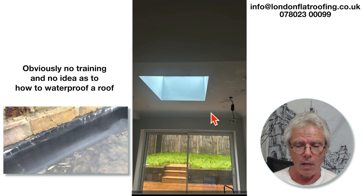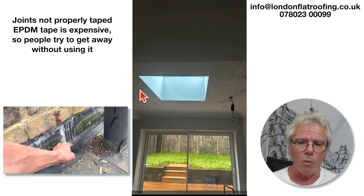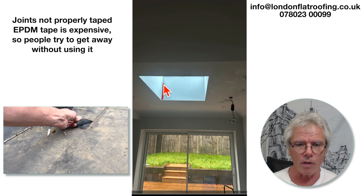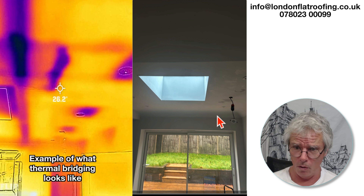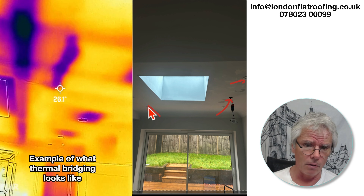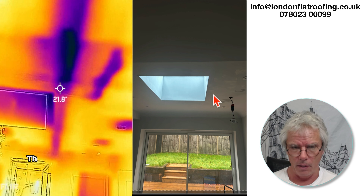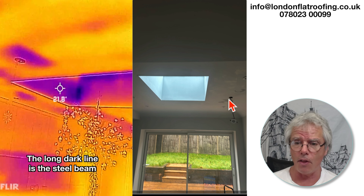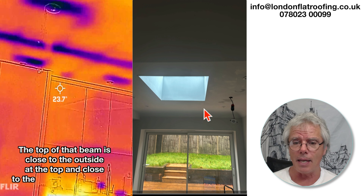Now we look inside. The reason they contacted me is because they have a leak, and we can see there's been a lot of water coming through. It's really important to analyze this. It would be really interesting to know what that measurement is to confirm this is a warm roof. If it's not a warm roof, look — you've got all these spotlights which are in the roof, which would mean movement of air into or under the roof covering. And if it's a cold roof, this is all going to be bridging the thermal insulation and causing problems.